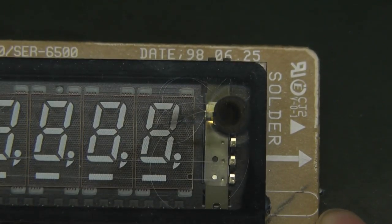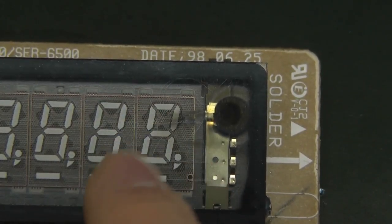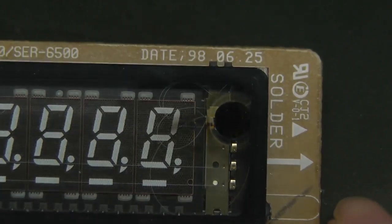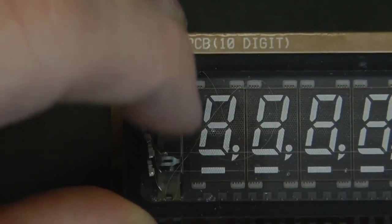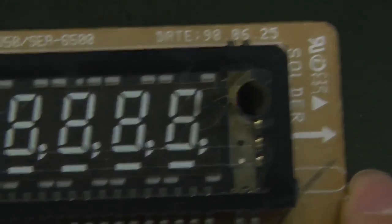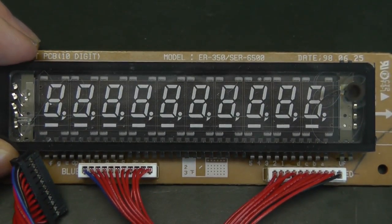The ring is not the same, and I think with time it will also change. Here you can also see the cathodes, they moved up. They've gone all here, I think, because of the pressure difference. That's fun to see. And here also, the cathodes rolled up here, maybe because of the pressure difference. And yeah, this changes color and will continue to change color and say this vacuum fluorescent display is definitely broken.